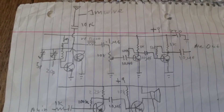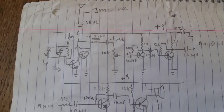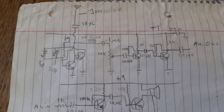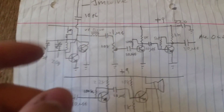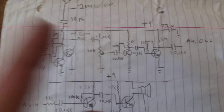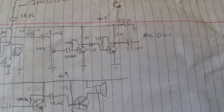On the input, which is the base of one transistor, and one end of the coil, there is a 1k resistor going to a 10k potentiometer, and that allows really fine tuning — that's right here. The output comes off of here, through an RF choke, through a 0.1 microfarad cap, then through a 10k resistor to ground, going to the first amplifier stage.